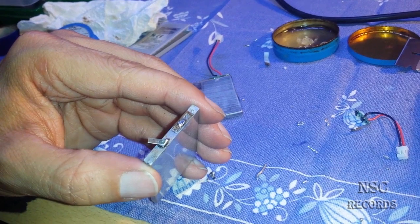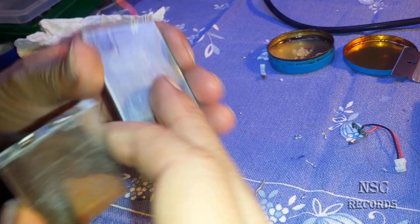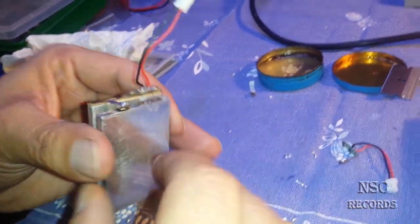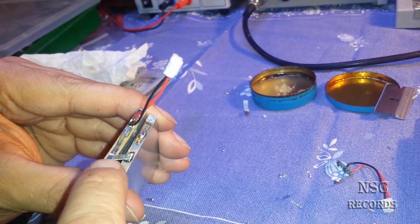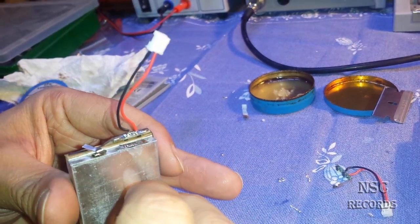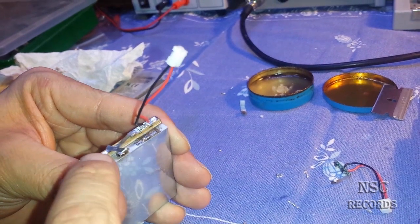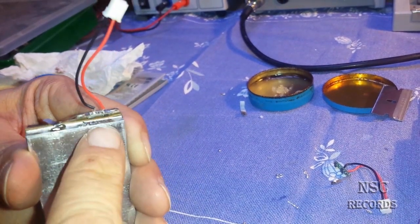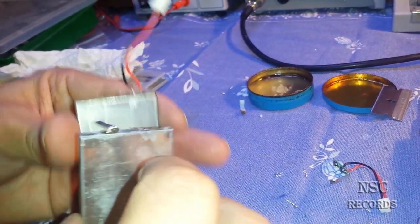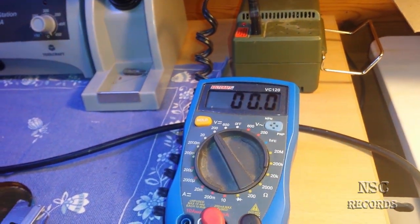You will really need a lot of soldering skills to do that. When you have done all this, you will just solder the contact over there. Make sure you put the same contact on the correct side — both sides need to be minus on one side and plus on the other. You can verify this with your multimeter if you don't know which side is which.